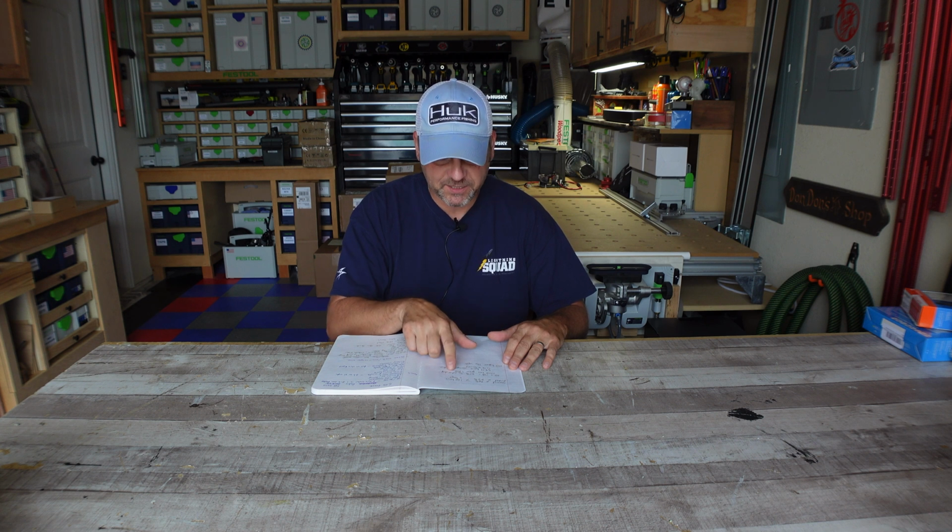Again, I started this test last Saturday, and the battery was at 98% full. I ended it this morning, Thursday, and the battery was at 22%. So roughly 6 days: Saturday, Sunday, Monday, Tuesday, Wednesday, Thursday. I knew that I would never be able to put enough solar input into that battery to cover what the chest freezer was using through the night. So it was a very slow drawdown on the battery.